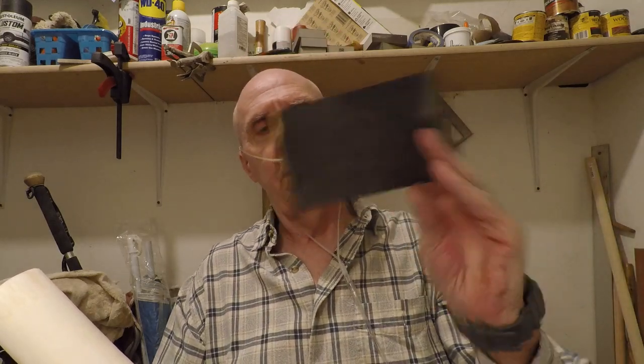And I've got, like I said, the hacksaw blade is really good, because they're pretty tough, and you can sand them down and hone them down to where they're just slick. I use 600 grit automotive sandpaper to go over or take it down the final little spot. Boy, I'll tell you, it makes it shine.